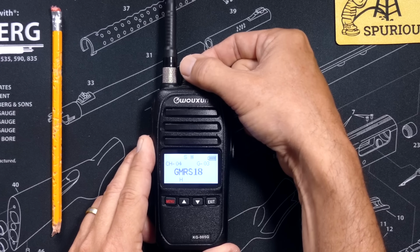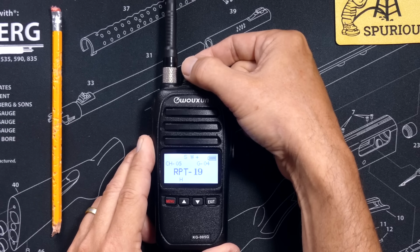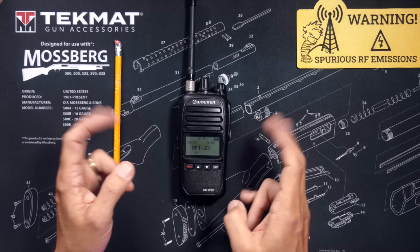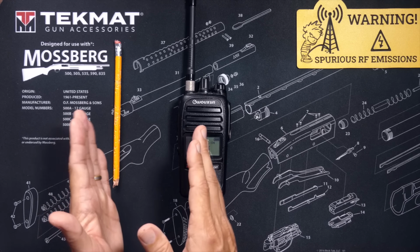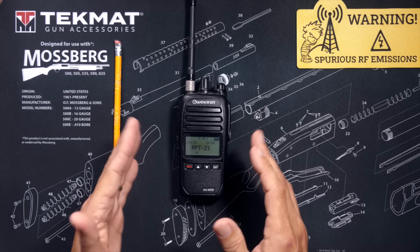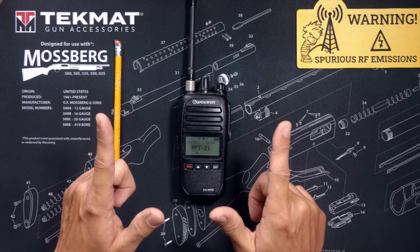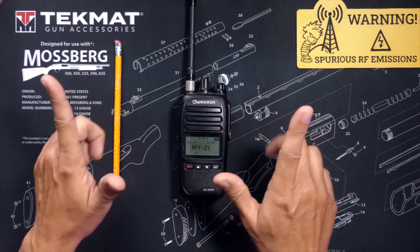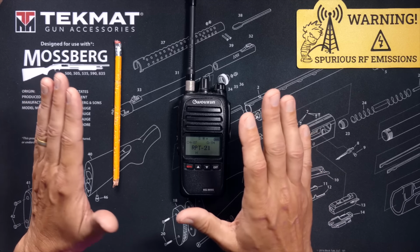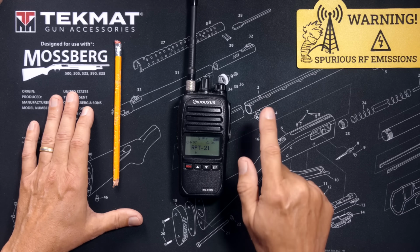Every repeater-capable GMRS radio has a minimum of 8 channels set aside for repeaters. These are channels 23 through channel 30, and those channels align with the regular simplex channels 15 through channel 22. Stay with me now. This is because GMRS shares simplex or regular channels with repeater channels. However, repeater channels are different. It is all very complicated and confuculating, so I will not confuculate you more with those details because they do not matter. Just trust me and follow along. And don't worry, you are doing great.